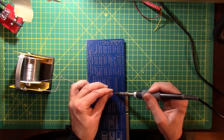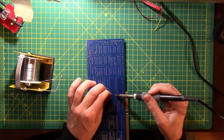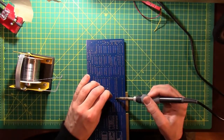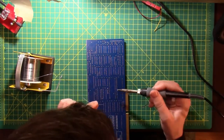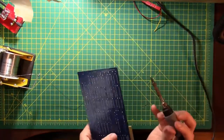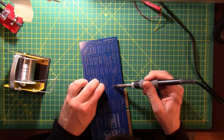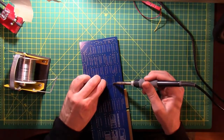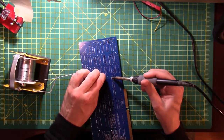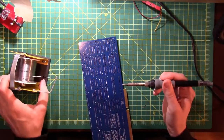And this project's all going somewhere. I'm actually going to be able to do some screen capturing of DOS programs and early versions of Windows that would actually run on this kind of hardware. And hopefully somebody will make a 286 board for this kind of system, or a 386SX type of board. I think anything bigger than a 386SX, you're probably going to be overpowering the bus. But I bet if you got a 386DX board and a good amount of cache RAM and system RAM on the card itself, it would be okay.